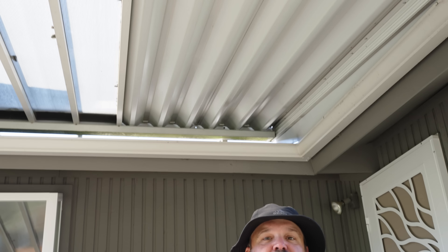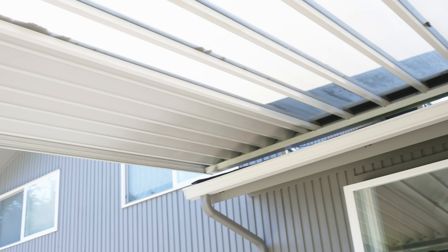Basically what we have here is an existing deck that we tore out last week. We kept the patio cover, which we have temporarily suspended with some pressure treated posts — we're keeping that, it's still in pretty good shape. We're building a 16 by 16 deck that's very low to the ground, only 14 inches off the ground, so we're not getting a building permit. We're going to use some footing blocks for support and a couple of cement anchors over some existing concrete.